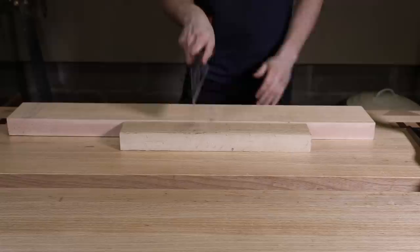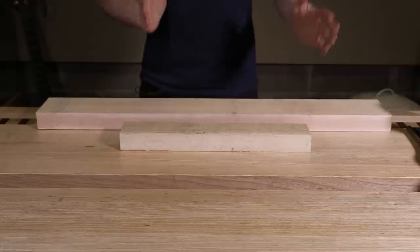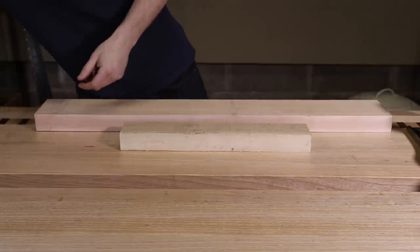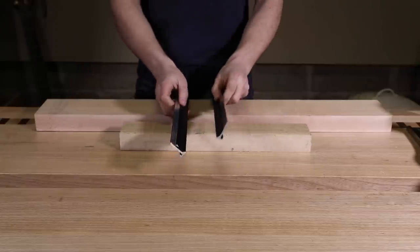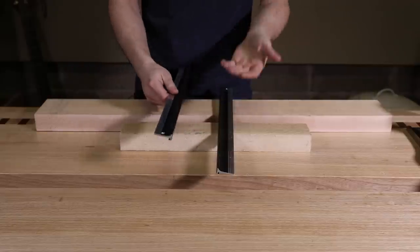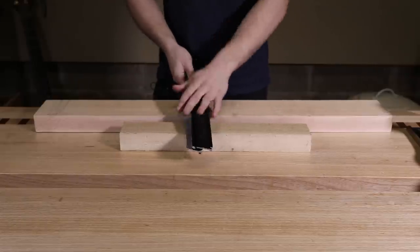A saw — you obviously need a saw to cut this bit of beech in half and to cut the splits off the end. Preferably this would be a cross cut saw, but you could also use a rip saw. If you're confused about what saws are out there, there's a link for that. A straight edge is quite nice to have for checking flatness but not essential — I'll show you later how to get around not having one. And finally, something really important for this project is a pair of winding sticks. I'll show you how to use these to make sure the timber is nice and flat. These ones are metal. The key thing with winding sticks is they must be perfectly parallel along their length and perfectly straight. I choose metal because it doesn't move over time the way wood does.